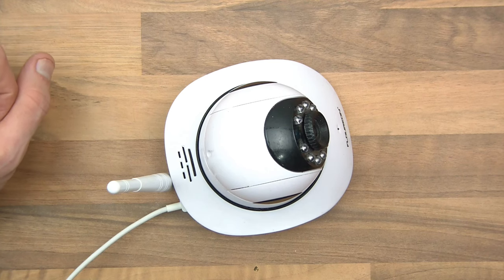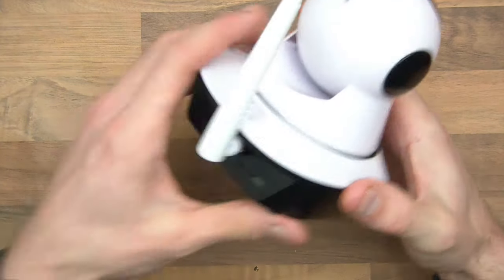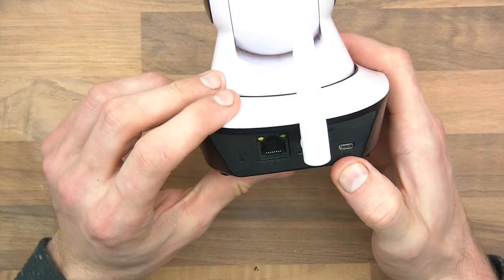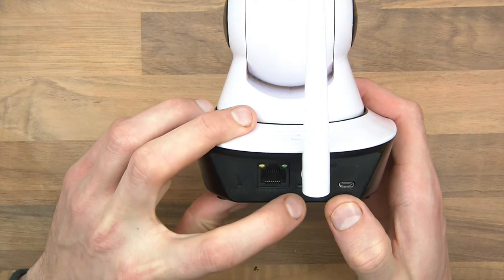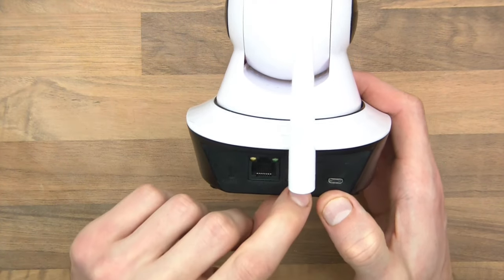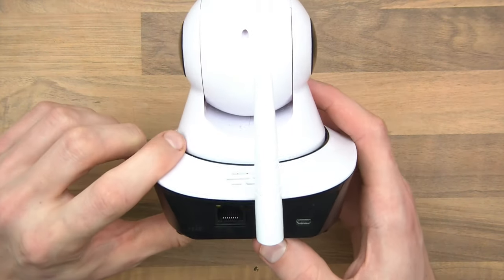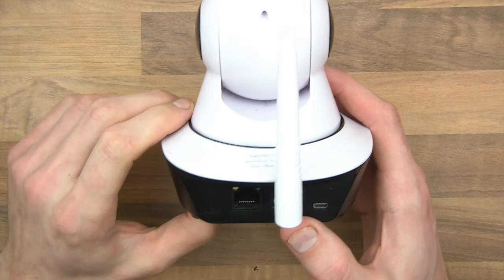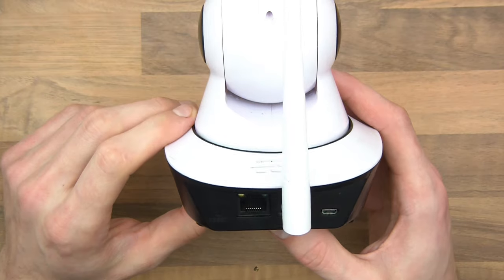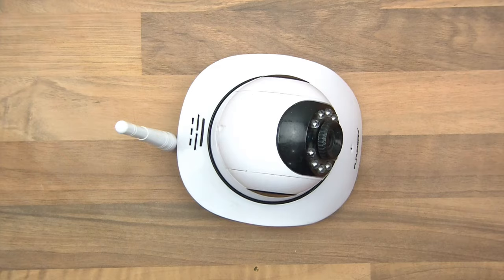I bought a wireless camera because I wanted it to be wireless, but it's not wireless — and that's a problem. So I'm going to make this thing wireless. The first thing I'll need to do is open it up and figure it out. You can see there's USB and of course ethernet — ethernet to set the thing up — and that's to do with memory storage, to put a card in, an antenna, and a USB input. We all know that USB is 5 volts, so it's a 5-volt input, and yeah, we can work with that. I'm going to get a screwdriver and open this up.